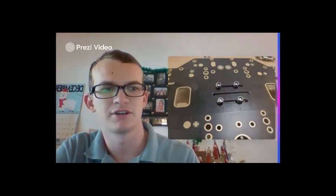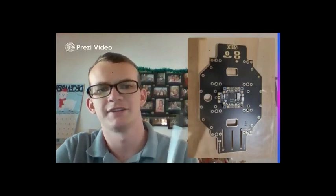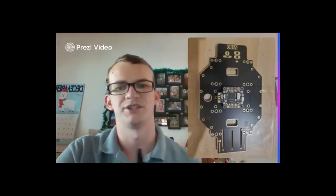Once you got the board attached, then you can slide the flight controller onto the black screws. And once those are ready, you should attach the 3D printed piece to your baseboard. You slide on the flight controller sitting on top, and then you will add your last four lock nuts to the top, being careful not to squish the gummies.